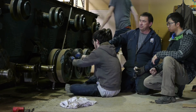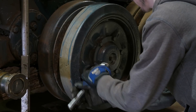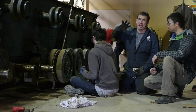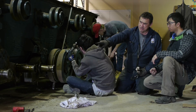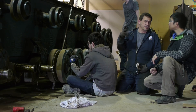Basically what we have to do: we start off with the grease cover on the outside, which is put on with six bolts with lock washers. Once we bend the lock washers and remove the six bolts, we remove the outer grease seal. Inside there you'll find a crenellated nut, as you can see on these ones here, and that's also locked on with a lock washer behind.